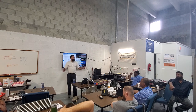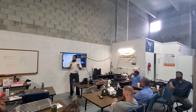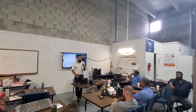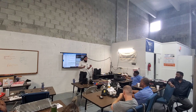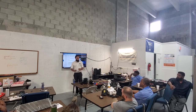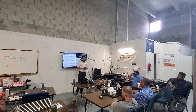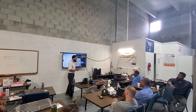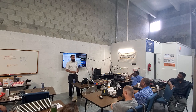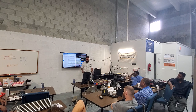Make sure, number one, we use the right collar. If it's 1/4, if it's 5/16, that thing must sit on there snug and tight. There could be no wiggle, no jiggle, no rattling. Tight, okay? And then what part of the compressor are we gonna put that on, sir? The service valve. Process stub, service stub, different strokes, different folks, but we all know what we mean, right?